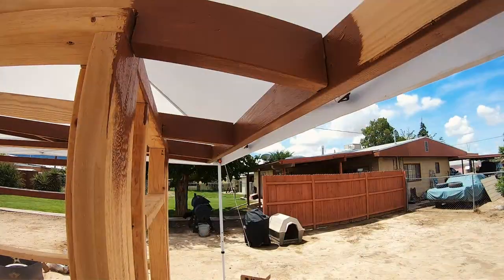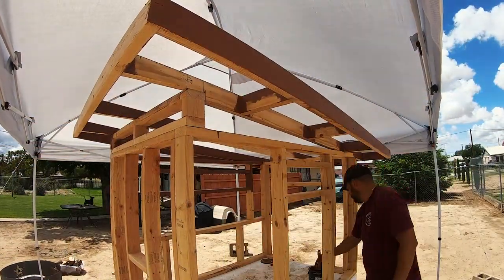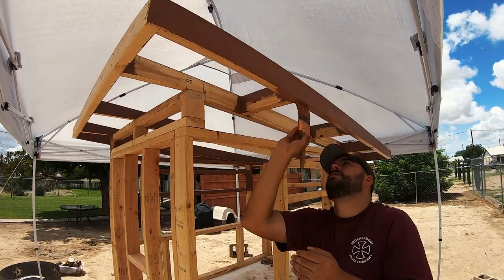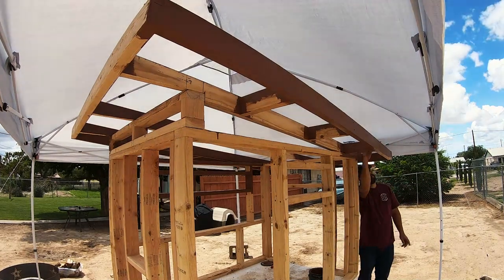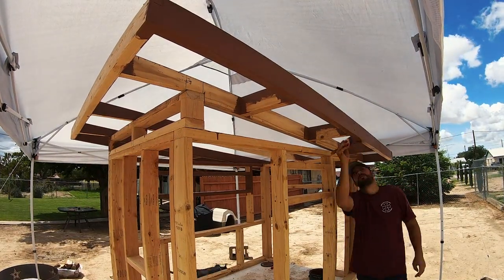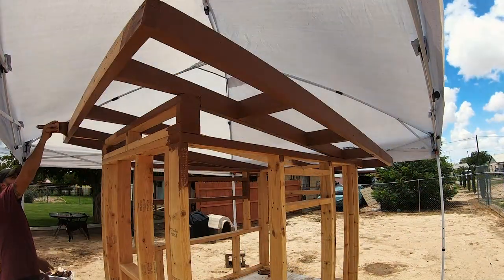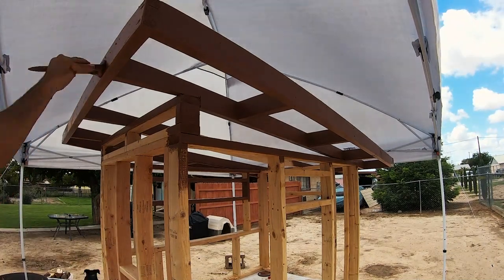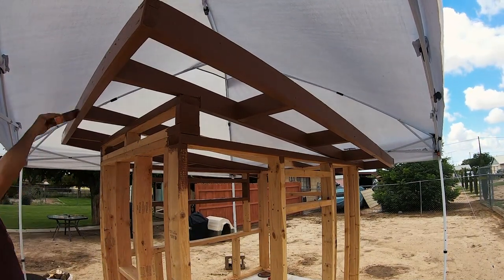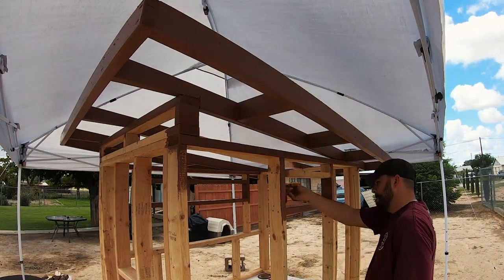As I'm actually doing this commentary, I'm realizing all the work it took me yesterday really didn't boil down into that much interesting content in terms of seeing a build, because like I said, I couldn't film the building. But regardless, I'm gonna try today. It is actually the 17th, today's Tuesday. I'm gonna try to get the roof built in terms of more stability, put the OSB on top, the black tarp paper, the drip edge, and maybe get the metal roof installed as well.